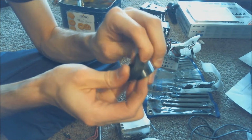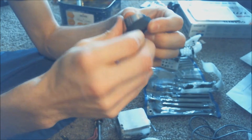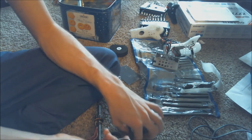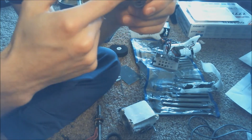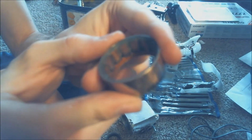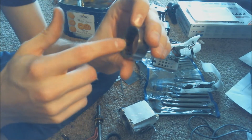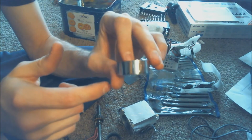And I put this piece of rubber that I found in a printer to just wrap around the outside and put it in here. It helps to shock mount it a little bit, so that it doesn't get too much force on the actual magnets themselves whenever there's a big hit. And then I put epoxy on the magnets to make sure that they would stay in place a little bit better. You guys couldn't see that, but there's epoxy all on the inside of here that makes it so that they don't break as easily. The epoxy that they put on in the factory is usually not enough, especially with those cheap Chinese motors that you get at Hobby King. But it's cheap, so what can you do?